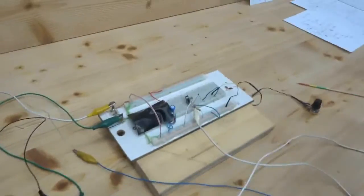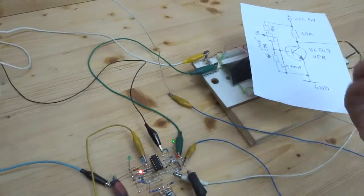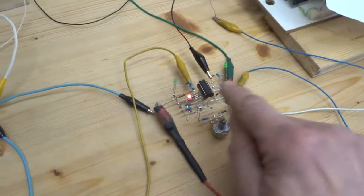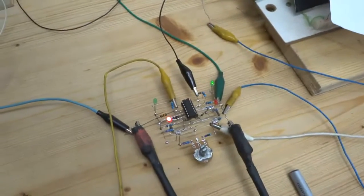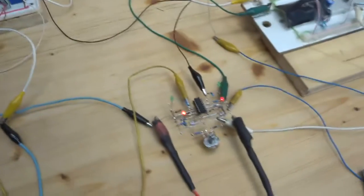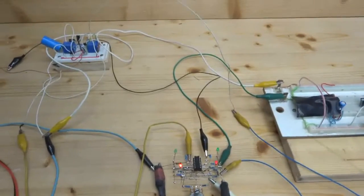wait a minute. There's a sheet of paper here. Does it work? Yeah. So if I cover the dusk sensor, meaning it's dark outside, the circuit no longer reacts to these two LDRs and keeps spinning until the end switch is reached, and the next morning the cycle can start over again. So yeah, I think now it's time to make all of this into a functional and usable circuit board.